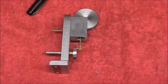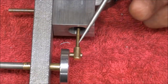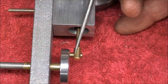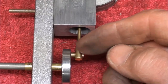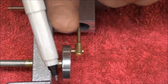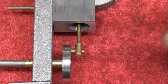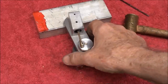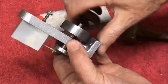I'm determining the position of the main bearing. I've got it roughly assembled again, and notice that my connecting rod is a little bit away from the crank pin, so I've got clearance there. I think I'll push the brass bearing just a little bit more so it's a little closer to the crank. Then I'll mark it with a pen, take it apart, and use Loctite to hold that brass bearing into the main upright. I have it temporarily assembled, checking for fit and final dimensions — it turns real nice with no tight spots.